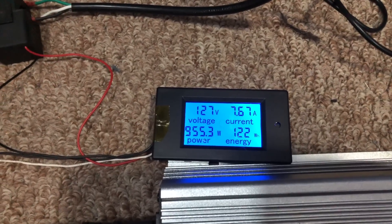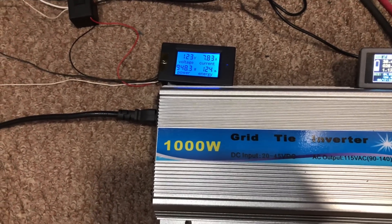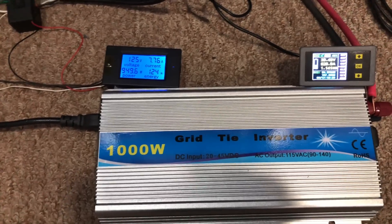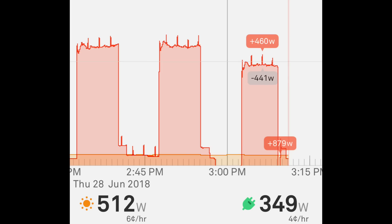So if you put six of these you'll start at 6,000 watts but end up at like 5,400 at the end. There's my AC unit just kicked on. At the peak it's about 5,000 watts, and with the unit running it's about 4,300 watts. So definitely with five or six of these we'll be able to cancel out the energy coming from the grid to run the AC unit for those 10 minutes it stays on.